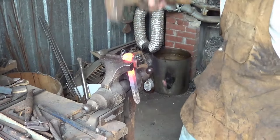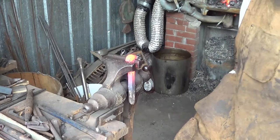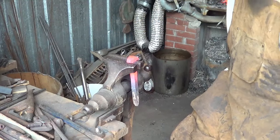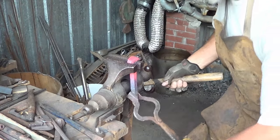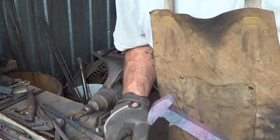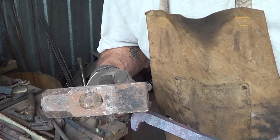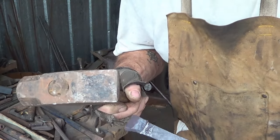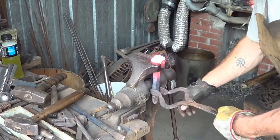We want it to be able to move a little bit. I'm going to work this top down towards the front and also work these horns out. I'm doing a little extra work on this one because of the odd shapes that we have going on. Now we have these horns a little bit more controlled - that extra mass we had on the nose, we dropped it and moved it up and out so we got a little bit more to work with. It looks much better. I still have a fold here I'm a little worried about for when we get to cutting the mouth. Let's go back to the heat.